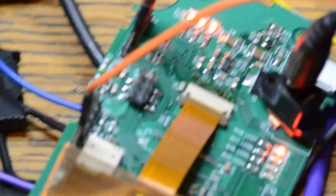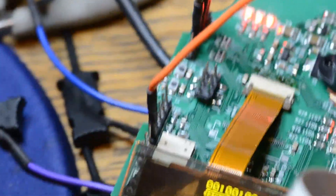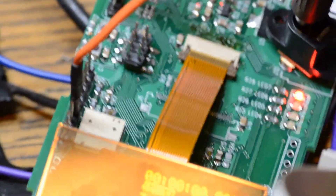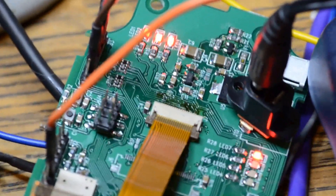Just in case you want to see some more of the board, we can stand up here. So there's the standard SPI in-circuit programmer header, the reset button, and a spare button that's tied to the bootloader pin using the default Atmel bootloaders. You can see the piezo speaker crystal there too. There's some user LEDs — most of these are defined when you're using the Arduino Leonardo code. The other header there is for the color OLED.